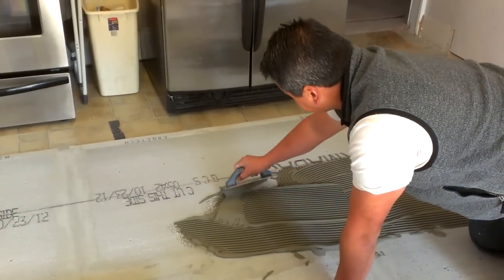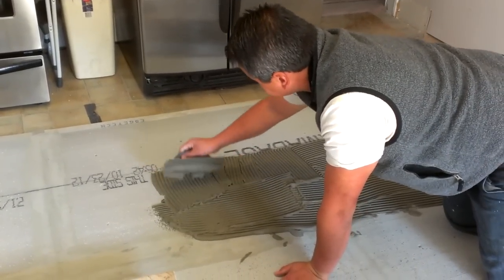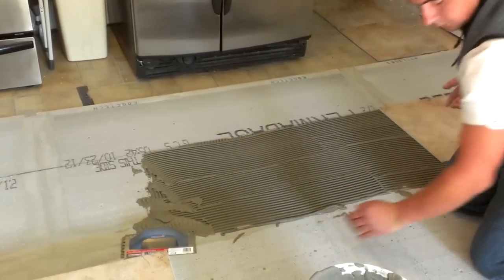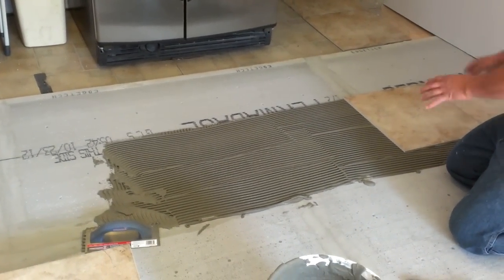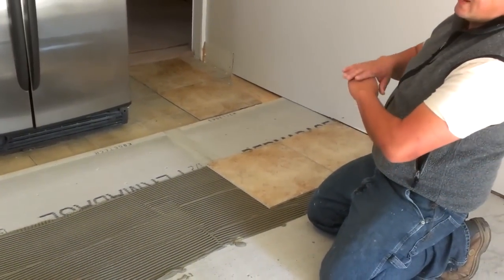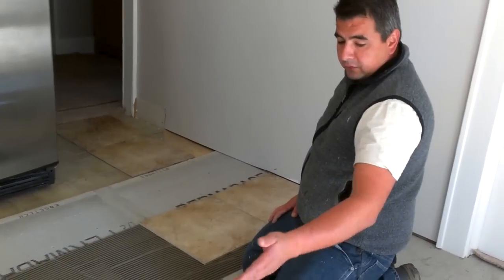As you can see, these tiles are pretty big and cover a lot of area. If one tile in a corner is a little lower, take it out with a spatula, add a little more cement in that area, and make sure the surface is nice and straight. Add a little, take a little off, put it back — just make sure the entire surface is always covered with cement, in this case polymer 45 thinset cement.